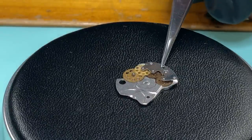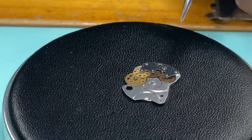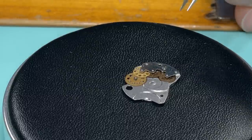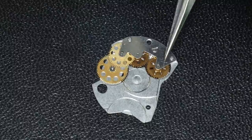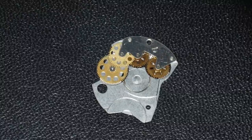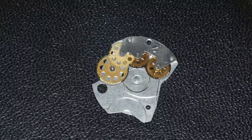And that is all this reverser setup. This is all to do with how it transfers the power from the rotor down into the main spring, and these are devilishly difficult sometimes to rebuild. You've got to get all the wheels in the right sequence, and just looking at this one, it doesn't look too bad. Some Omegas that I've done in the past have been horrific.